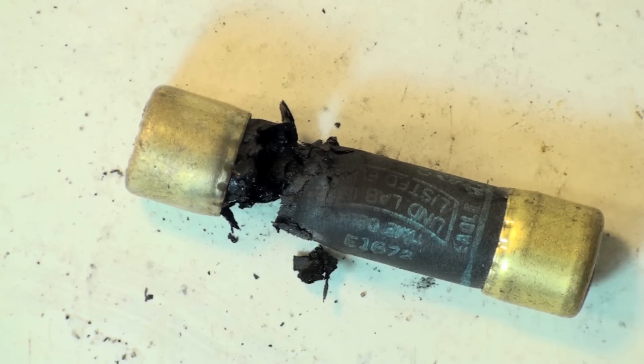Because of an overload, the fuse would have simply blown. There's nothing wrong with this fuse itself — the problem is it does not make good contact with the clamp it's in. When you see a fuse that's burned on one end, it is not the fuse that is the problem. It is the connections: either the wires going to the disconnect are loose, or the clamps themselves are weak.